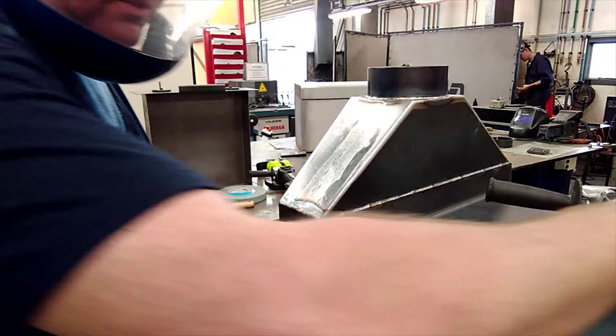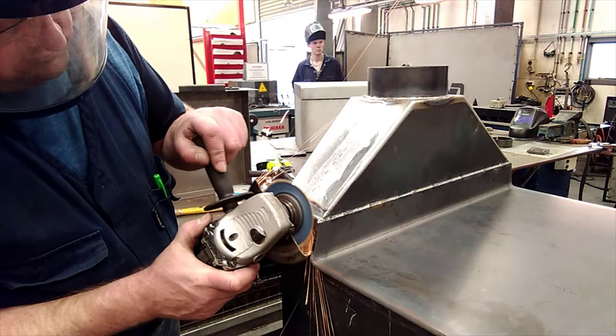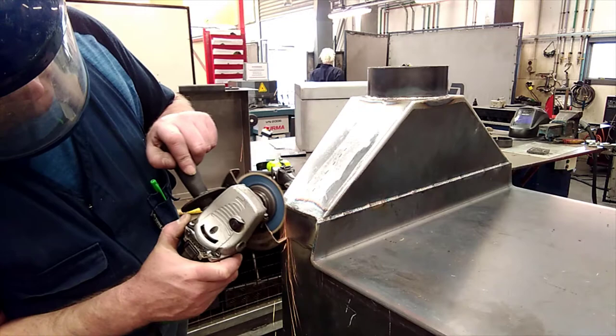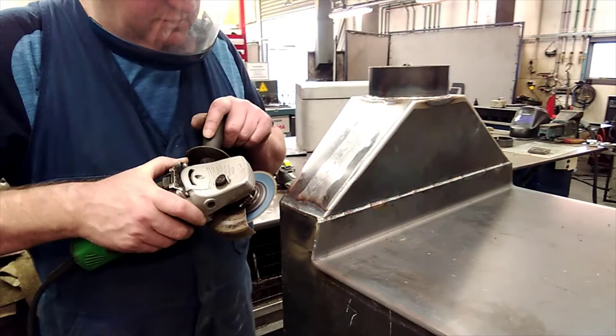At this point I'm cleaning up the end weld. I've got a grinder with a grinding disc on it. I've overfilled the weld so that it's actually sitting up above the surface. So when I grind it and sand it and orbital sand it, I've got material to take off. I don't want any hollows in it where I would have to go back and fill it in. So grinding the excess bulk off the weld